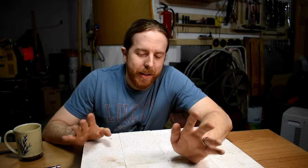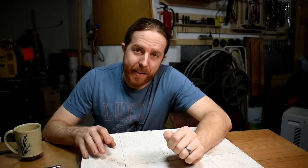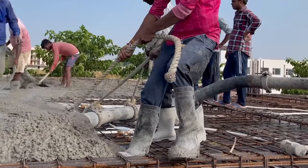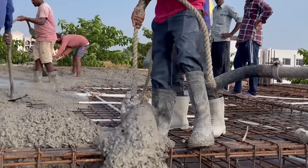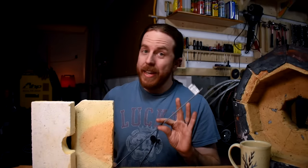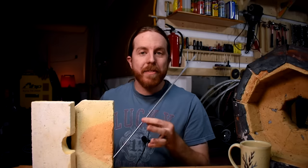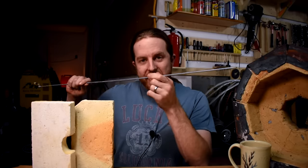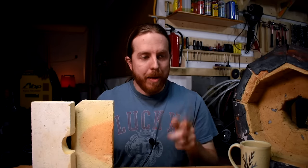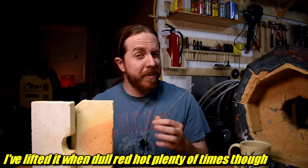All I've done is kick the can down the road a little bit — this is all just gonna happen again. How do I prevent it? I'm too lazy to redesign the whole thing from scratch right now, so I'm going to reinforce the bricks. Reinforced concrete has long rebar poles to add tensile strength and support — clearly I need to do that here, but not with rebar. This is steel. I never get the inside quite up to steel melting temperature, though it's definitely hot enough to weaken steel — but I'm not putting it inside, I'm putting it through the bricks. They just need enough strength so that if the top starts bending this can hold it in place. I'm keeping the band clamp tight and only lifting the lid when the thing is turned off. This should be good enough. Fingers crossed.